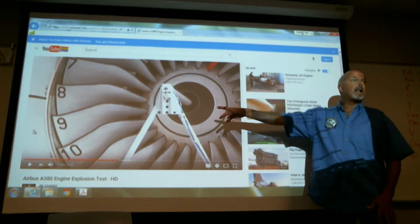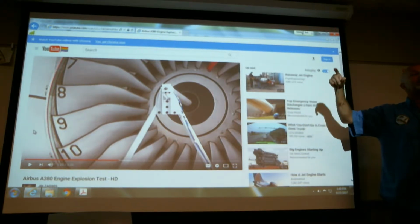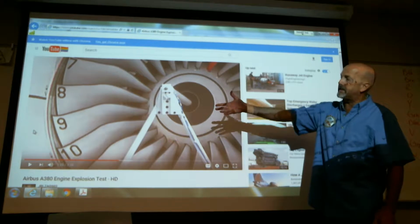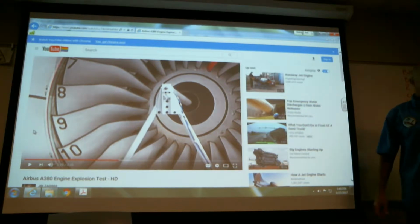it's replaced, and they're balanced. So there used to be a whole process where we put in a blade as closely matched as possible, and we'd have to balance it, and it was kind of a lengthy process, but we figured out a quicker and easier way to do that. If the number 9 blade were damaged, we would replace number 9 and the blade completely opposite of it.